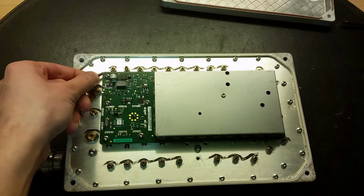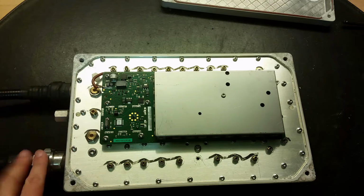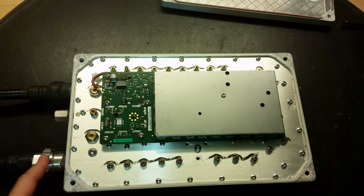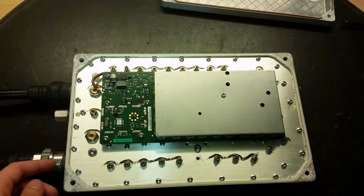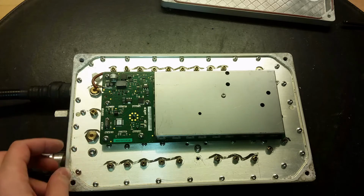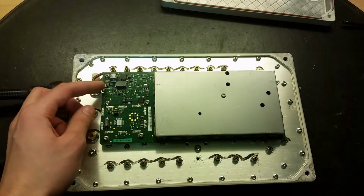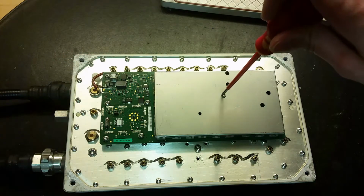Looks like a wire going into that. Maybe that's the power from the BTS. So the BTS always have some power in this cable, some DC, maybe it's like 24 volts or something like that. There's a capacitive coupling in here, so it doesn't go into the duplexer, which is just a short circuit for DC. And the DC comes here, have some AC filtering, some surge protections.